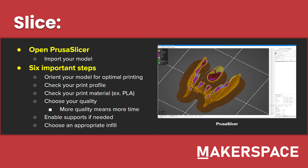You'll want to choose your quality. The lower the number means the higher the quality because those layer heights are much shorter. Whenever your filament is being shot out the end of the 3D printer and it's slowly building your object, it's doing it layer by layer. The smaller those layers are, the higher detail it's going to be. However, that also means increased time. For example, if your layer height was 0.1 millimeters, having a layer height of 0.05 millimeters would take nearly double the time because you are splitting it into double the amount of layers. Try to find a good balance between the two. There are also some labels within PrusaSlicer for which print qualities are pretty good for different types of prints if you're a little lost.